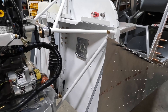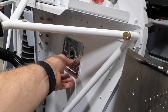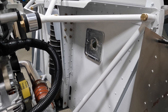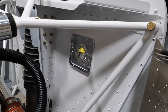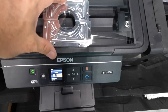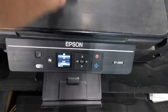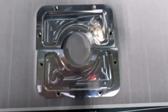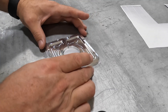If you're ever working on something like a mounting plate where you need to drill exact holes and you're fumbling trying to hold everything up — here's a quick method. Take the device you need to make a hole template for over to your printer, copier, or scanner, and make a one-to-one copy. It creates an exact hole template. You can make as many as you need, punch holes in them, tape them onto things. Just cut it out, place it where you need your holes, and you're good to go. Works on all kinds of devices.